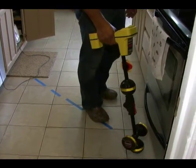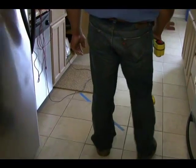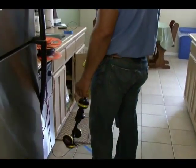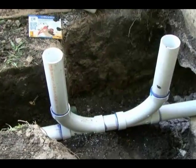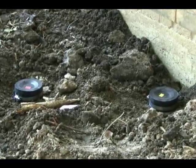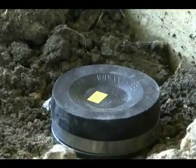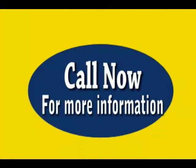Now what you're about to see is where we actually dug up the line and you will see the pipe in that line. Once we uncover the pipe, then we would actually cut into the pipe. At that point, we would actually install the clean outs and then we would cover everything back up. You can see the caps there — those are the clean outs totally covered up and we will be finished. Then we could either do a test or do a camera inspection depending on the situation. Thank you.